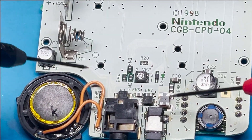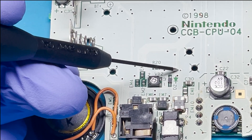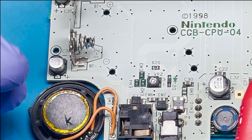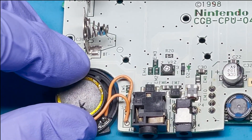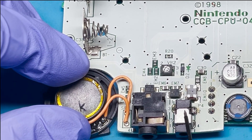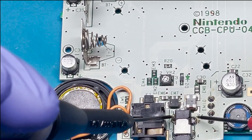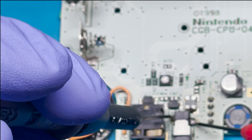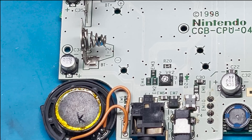Let's go ahead and test this again. I didn't do this side because it's a little risky — I don't think I can get into the space without potentially damaging anything, and I don't think the tip of my soldering iron will reach. I can probably desolder this entire piece and then resolder it back on, and that might fix it. That's the next step since I'm still not getting any continuity here when I test it. I'm not getting anything, so let's go ahead and desolder this and see if we can fix that.